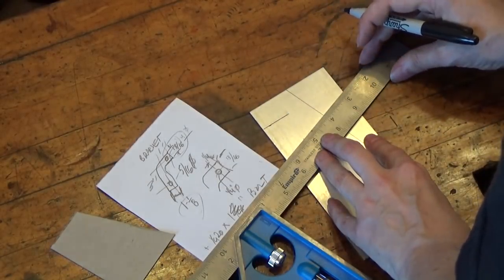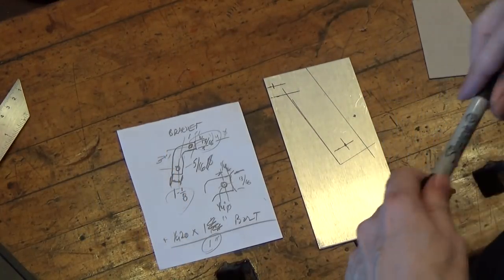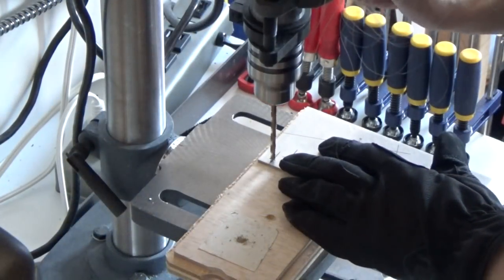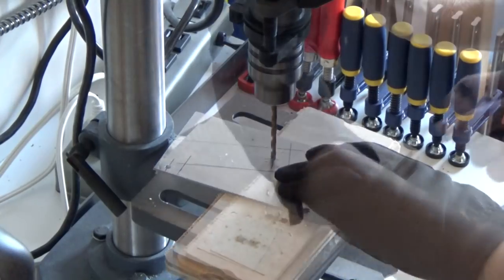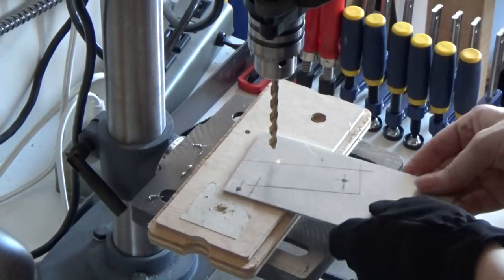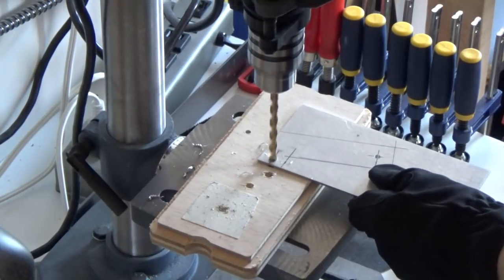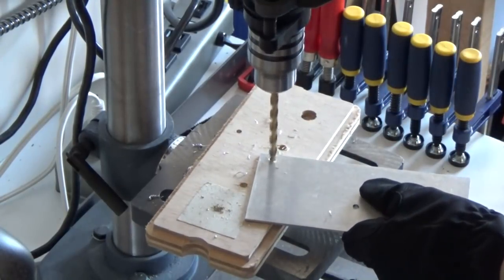So it's just a matter of marking it on the plate where I'm going to have to machine out some holes — one for a 1/4 inch bolt to mount on the new horn, and one for a 5/16 inch clearance for that metric bolt, which is part of the original mounting. The first thing I'm going to do is drill out the holes, starting out with a small bit, then doing several bit changes to gradually increase the size. And I do the trick where when you get to the final bit size, you drill about halfway through, then flip the plate over and drill through the rest of the way from the back side — it makes a nice, clean, flush drill on the other side.